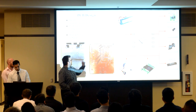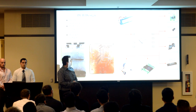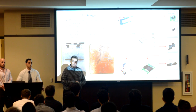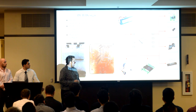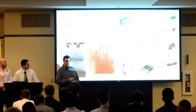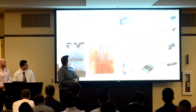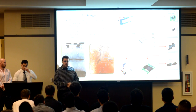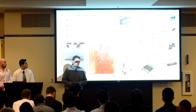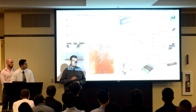Our locomotion board runs our DC to DC converters, which step down the voltage to acceptable levels. The second thing it runs is our motor drivers, which are connected to our electric motors. The speed and direction of these electric motors is varied with PWM. This gives us the ability to traverse the course in the most efficient way possible. Our power source is a 22.2 volt lithium polymer power cell. This power cell creates a very high current, so those DC to DC converters are crucial to our design because they create two supplies, a 3.3 and a 5 volt supply.